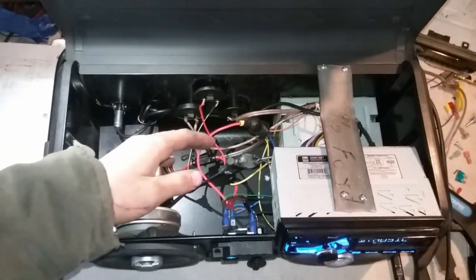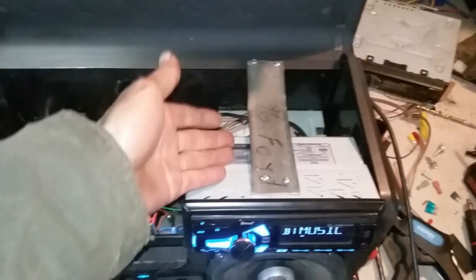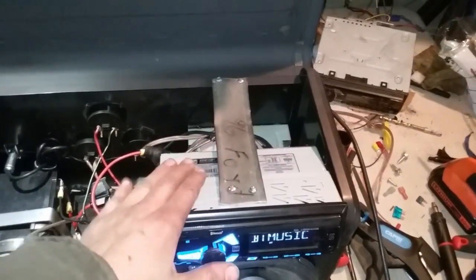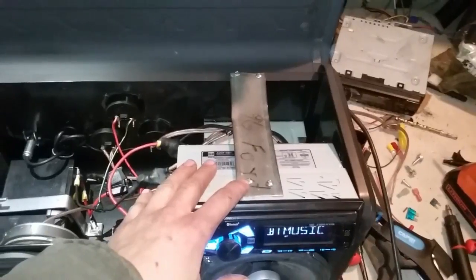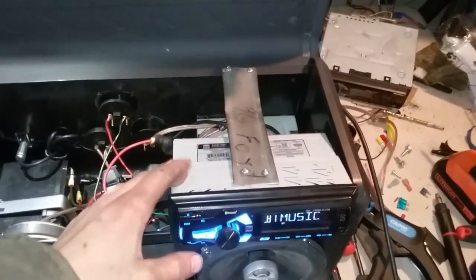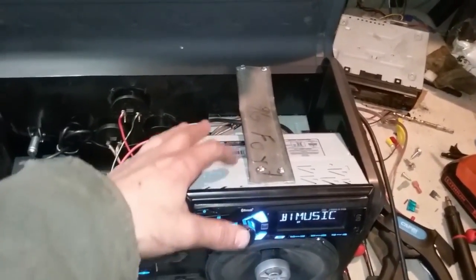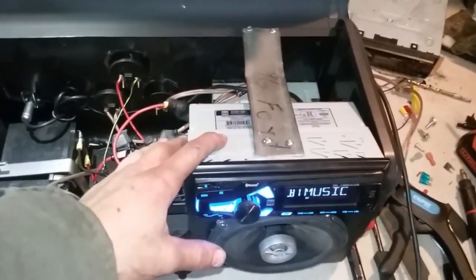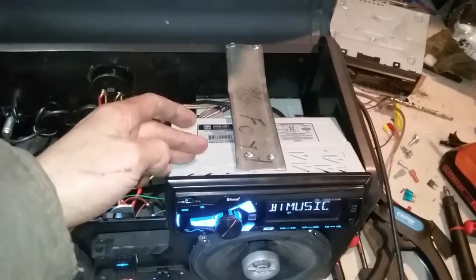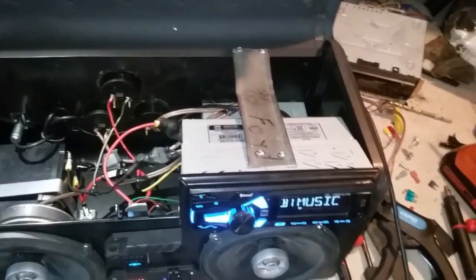We have tried to get everything wire tied a little bit, make it a little cleaner. And let's move on to the front. The head unit, I just have two self-tappers in the top of it. Be careful whenever you're doing this, because you don't want shavings to get inside of there. And also, if you have a CD player, you cannot run self-tappers through the middle of this. This one does not have a CD player. I opened it up, and there was no electronics in there that would have gotten damaged by the self-tappers. So I just have that self-tapped to the back also.